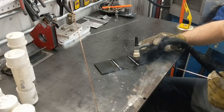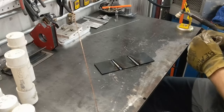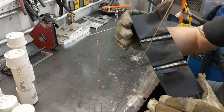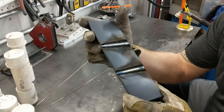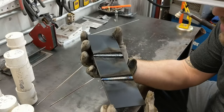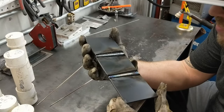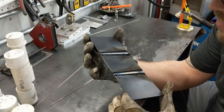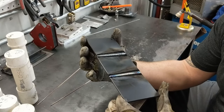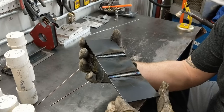It does stink when welding, but it welds really nicely. I didn't have any problems - it burnt through well. That's super handy if you're trying to add tabs to an already coated roll cage, rear end, or any kind of chassis or suspension component - you don't even have to sand it, just weld right over it. Now I'll let it cool down, mask half of it off, and try a recoat to see how it recoats - whether it looks good, has a hard line, or how durable it is going directly over itself.